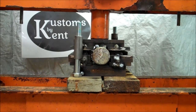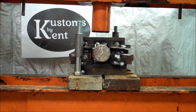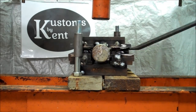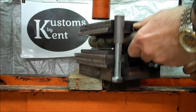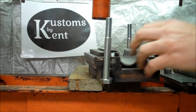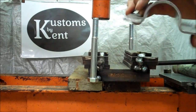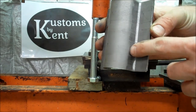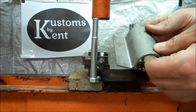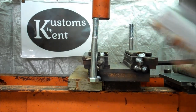It looks pretty nice right there. I'm going to go ahead and release it up. Got a little crowbar to pry the top back off. There's our part — nice and even edges. You can see where it drew down into the die there. I rounded the edges of the die so it could draw down in there. Those are just cosmetic scratches. The part turned out nice and even, nice and centered up. We just got to make three more of those.